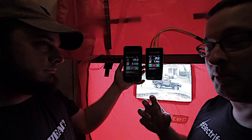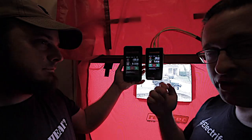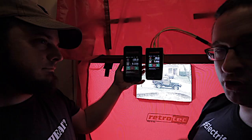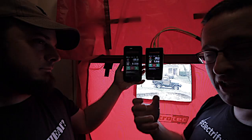But the problem is here, if you have duct work outside the house where it's in your attic, if you have a duct leak of air conditioning into your attic, you really have a double whammy, because not only are you trying to cool the attic rather than cooling the house as you're trying to, but that cool air that's blowing out, there's more outside air getting pulled into the house elsewhere that you then have to dehumidify and cool again. So sealing duct leakage is critical.